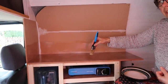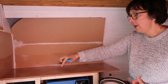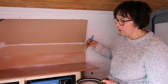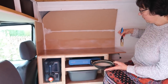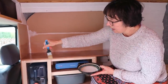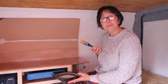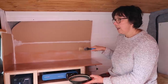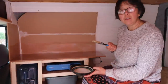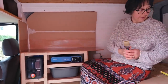I had concerns over the amount of water in the fix and grout you use, and this is MDF, so I've just sealed it with a couple of coats of PVA glue. That's the second coat going on now, all over the front and down to seal it before we put the worktop on. Sealed the edges too, before we put up the splashback tiles. We're going to leave that to dry and crack on with a few other little jobs, then come and tile this afternoon when it's dry. Feels really well sealed.